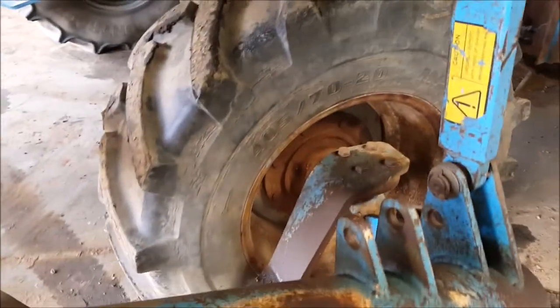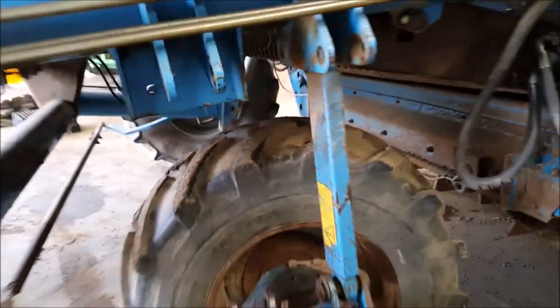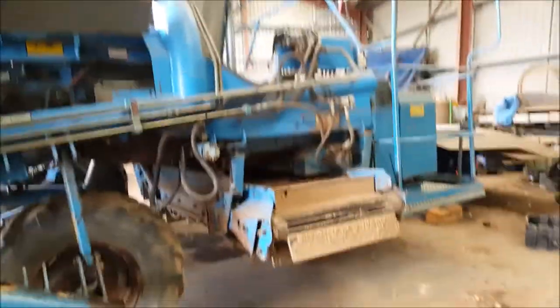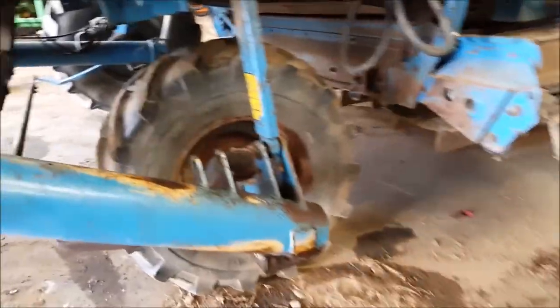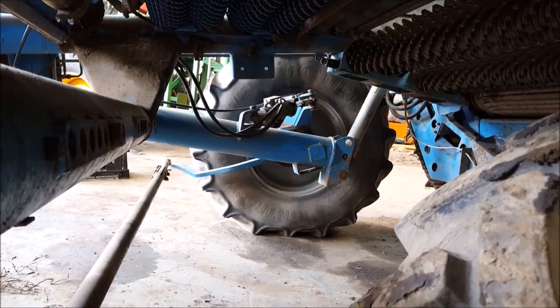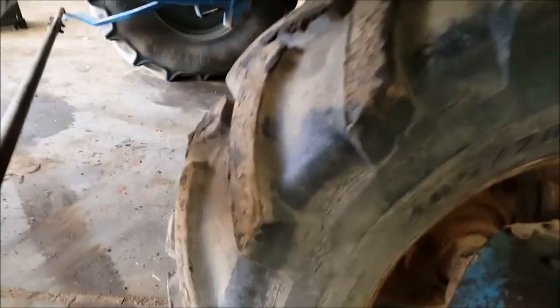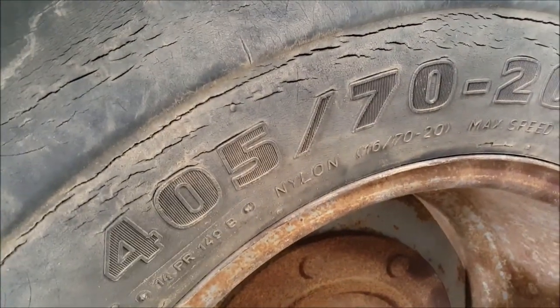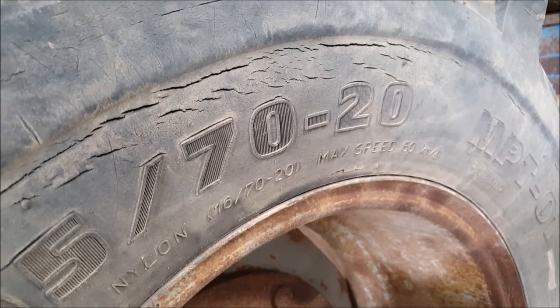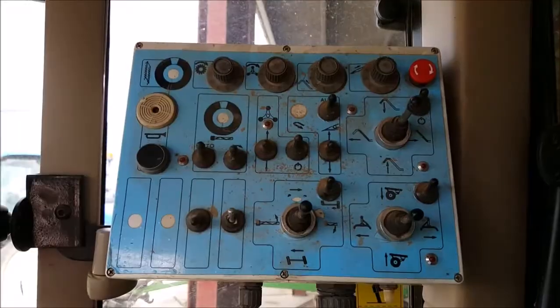Just like the sprayer, this also has a steering axle, but this isn't computerized — it's manually done up in the cab by the driver to try and get in sharper on your ends. Because it's such a long machine you'd have to have very large headlands, so this just minimizes that headland area. You'll have a little lever in the cab on the control box and you'll flick that yourself whenever you're steering. The tyres on this are a bit unusual — that far one is on the outside this one's on the inside and smaller. It's 405s by 70s on one side and 420s by 85R on the other, and I can't quite remember why you have different-sized tyres.